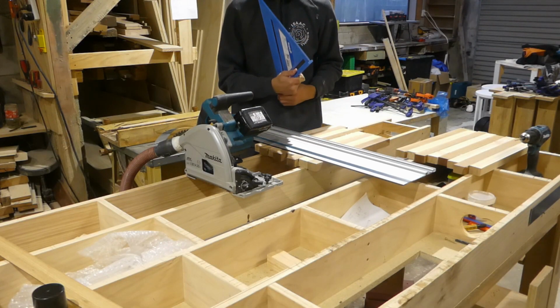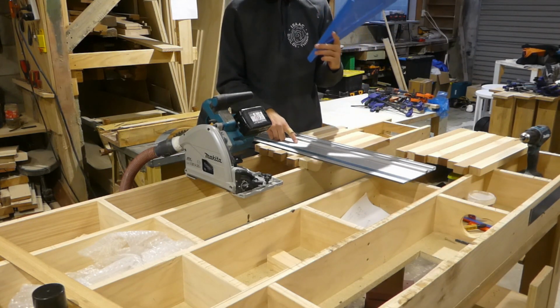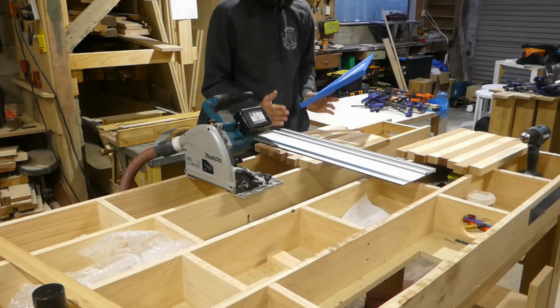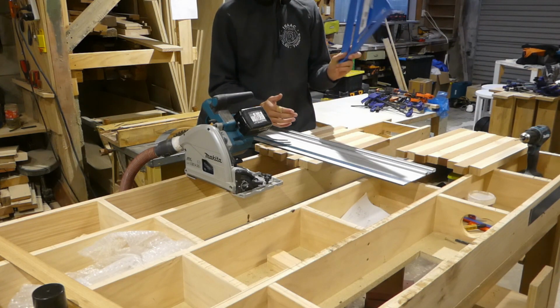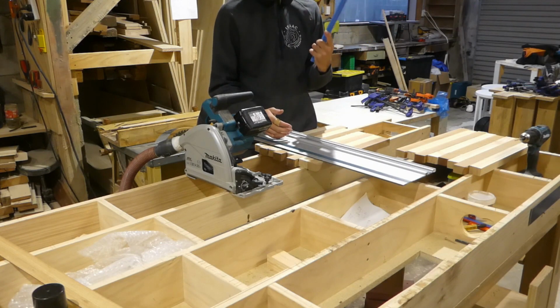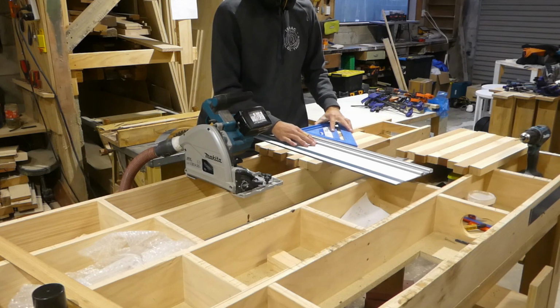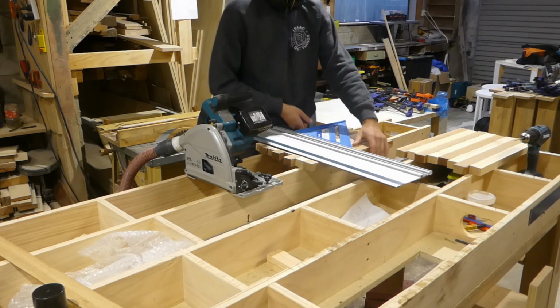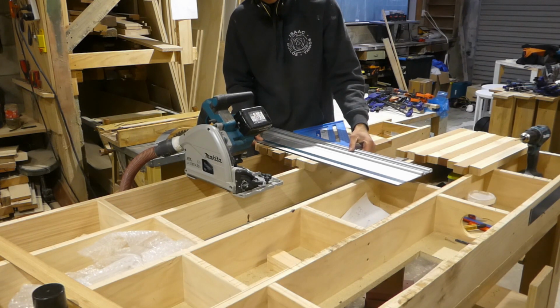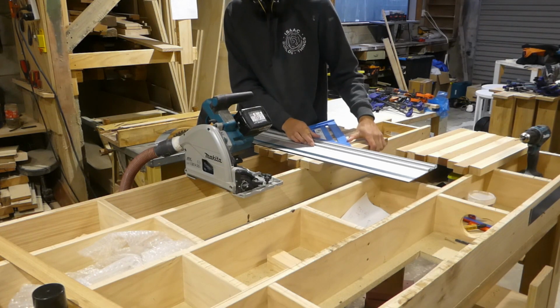It's a little trick for squaring up your rail saw cuts. So I don't have a fancy right angle thing for my rail saw, but I do have a big rafter set square. So this is awesome for chucking on the board and then squaring up my rail, get it near the edge, square it up, and boompa, we have a right angle.